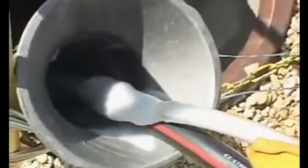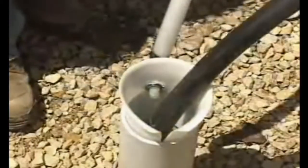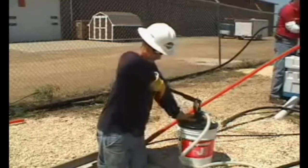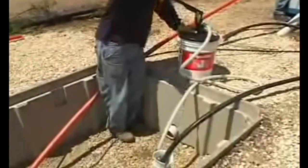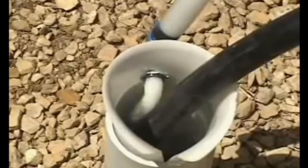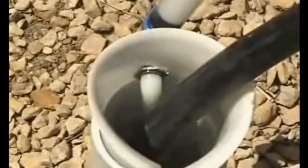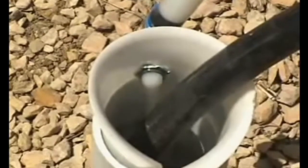American Polywater makes three hose attachment lubricators that work with the pumps. The first, which is supplied with all pumps, is a flexible cable guide attachment. The lubricating cable guide works well in a vertical stub-up conduit. The lubricating sleeve guides the cable into the conduit and protects it from the sharp edges of the duct. Lubricant is applied on the cable as it enters the conduit. Position the lubricant output port towards the first inside bend of the conduit so lubricant is coated on the rubbing side of the cable.